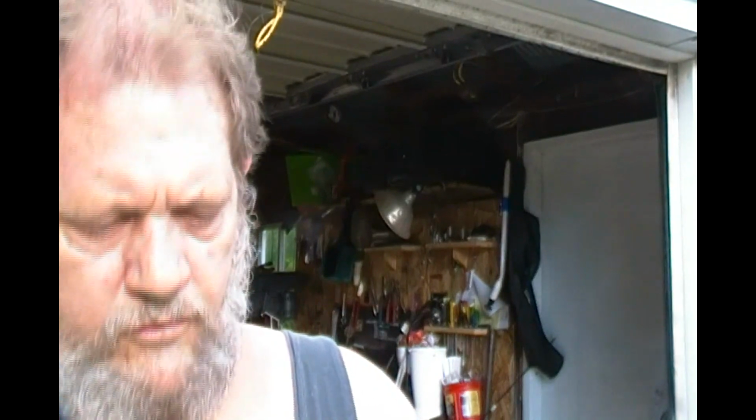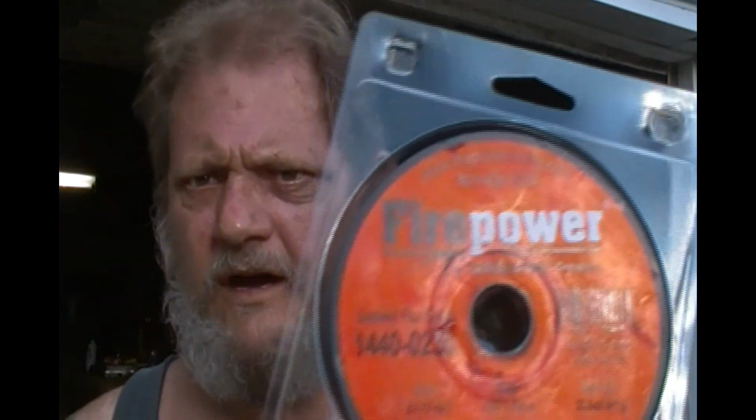KT Industries Incorporated is what they sell over there. And what I usually get out at O'Reilly's is this, Firepower. And I'll tell you what, I spooled this up. I did that trick that T-Man was mentioning. His welder was spurting. It would go and stop and go and stop. And somebody on that video commented that you might have dust and dirt inside the liner in the torch hose, to take the wire out and blow it out. So I did that to mine because I was having that problem too. And that helped, by the way, just so y'all know.